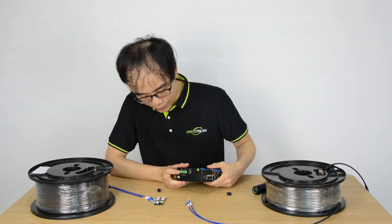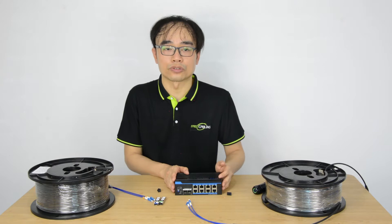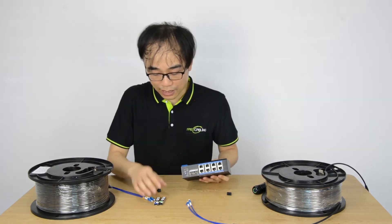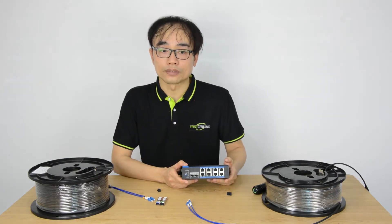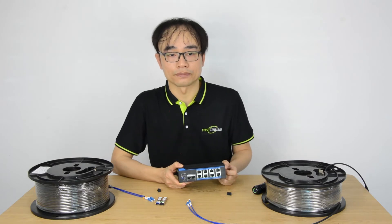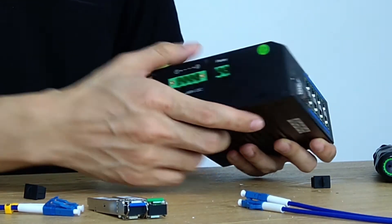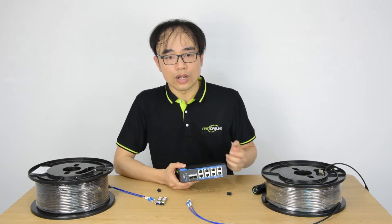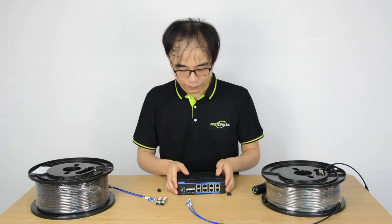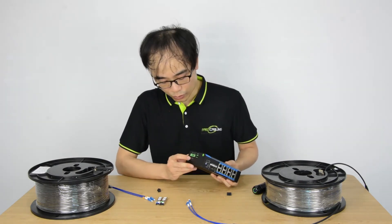On the other side is the terminal which connects to the external power. It is very important to pick an industry-grade power supply unit, because most likely this switch will be used outdoors. The temperature could go up sharply in summer, so the switch and SFP module require industry-grade components. The advantage of industry-grade products is they can withstand a wide temperature range, which is very important for outdoor deployment. This switch also accepts DC 12V to DC 48V input, which means it also works with a solar panel system. A solar panel power system requires wide voltage input because the battery voltage changes as power is consumed.